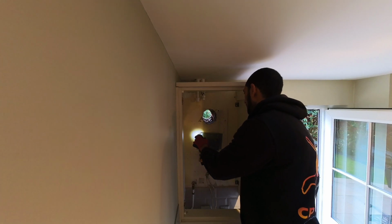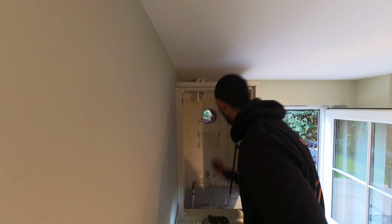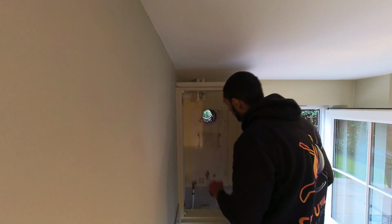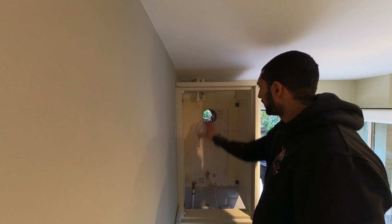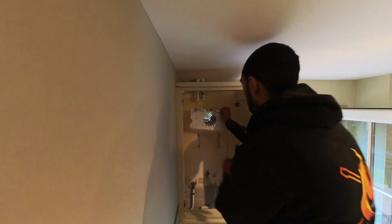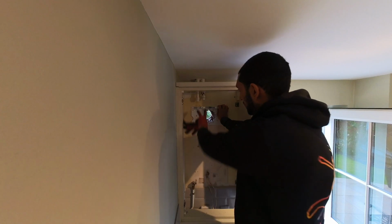Right, it's dot and dab, so I'll probably get Corefix screws. So we've got a cavity here as well. Right, boiler's off. Just got to line up the template. Because we're going with the rear flue, our template is literally just going to go there. I might have to cut these a little bit higher, otherwise the tails are literally just there.